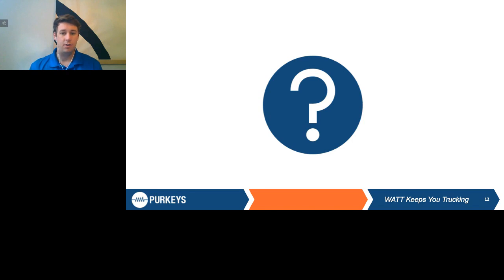I think we have one more that just came in, sorry. Do you have any moisture issue with these boxes? This is rated to be on the outside of the trailer. I'm not sure what the exact IP rating is. IP66 is the IP rating. Yeah, so I've been told not to submerge it in like 3 or 4 feet of water for a long period of time. That's not what it's designed for, but any kind of rain, any kind of just basic humidity, salt spray, any of that, it's rated to withstand and work in.